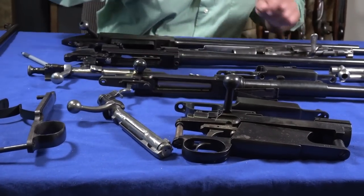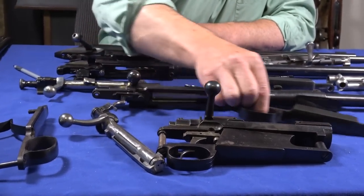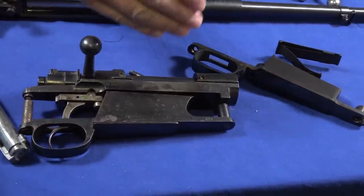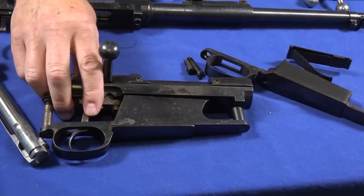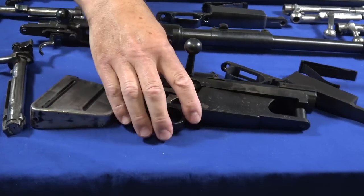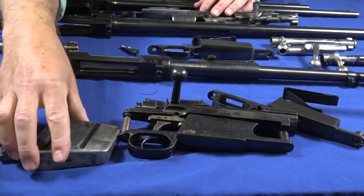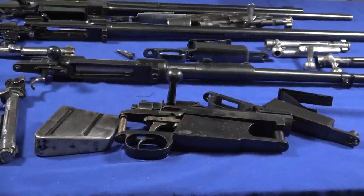This is a Siamese Mauser. You may notice the box magazine has a different shape - this one is straight roughly, and this one is angled. That's because the Siamese military cartridge is bigger at the back and it's rimmed, so stacked in the magazine the Siamese cartridge takes on a fan shape. That's why you don't find many Mausers with rimmed cartridges - it's hard to manage in the Mauser system. For Lee Enfield fans: this is for the .303 British, which also has a rimmed cartridge - Lee handled a rimmed cartridge by creating more room at the back.